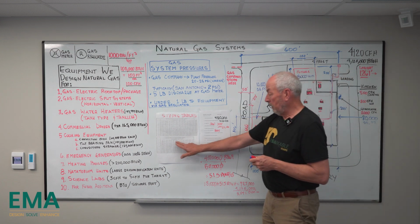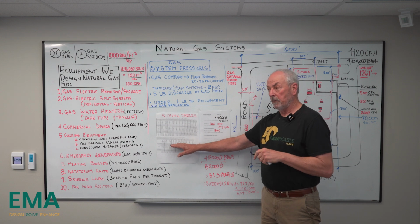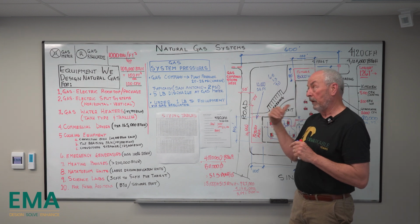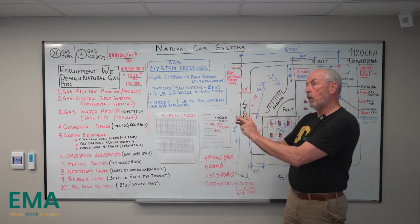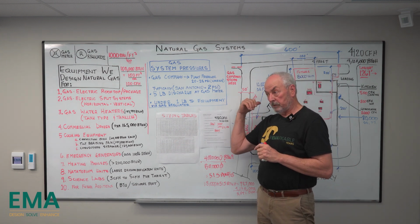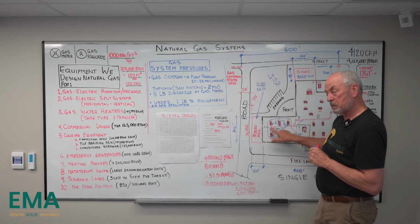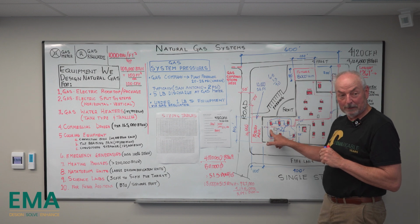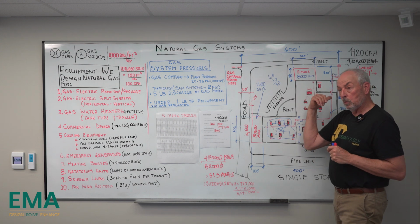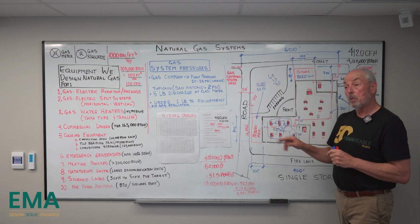That might be where we come in and say, well, this is a conservative table, and I can show y'all the comparison between this table and the 3.5 PSI drop. What it's allowing you to do is flow more load through a 3-inch on the 3.5 PSI drop than this table, because it's leaving you with less PSI at the end, versus this one leaving you 4.5 PSI. It's leaving you 1.5 on the other table with a higher pressure drop, but you can flow more.